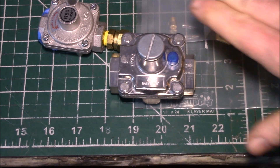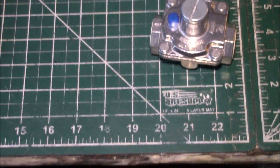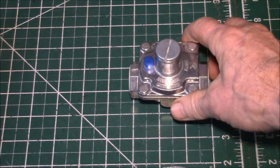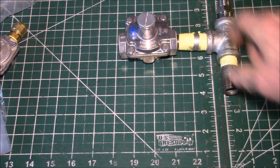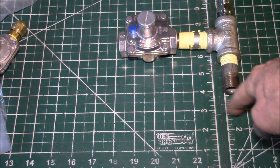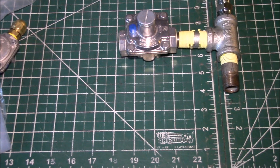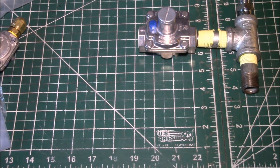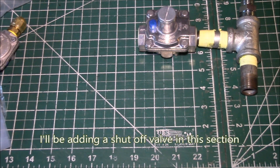To switch fuel I just have to get to that screw top, unscrew it, flip the plunger over, and put it back together. Let me swing up here and take a look at how this is all going to go together. I've got my regulator — this is where my natural gas will connect in. The gas pipe comes out of the wall of the house right down here. There's a valve, and I'll probably put a union here so I can take this whole thing off if I need to.